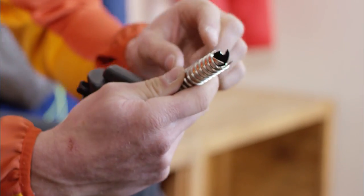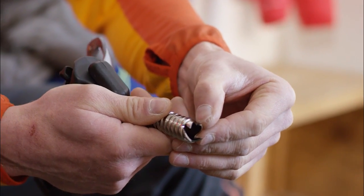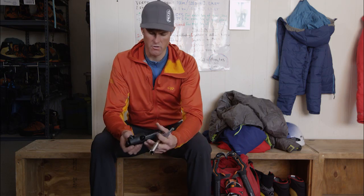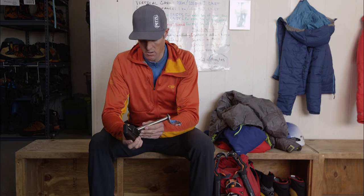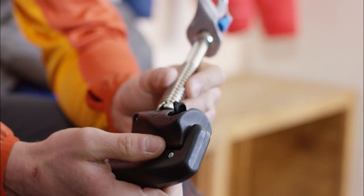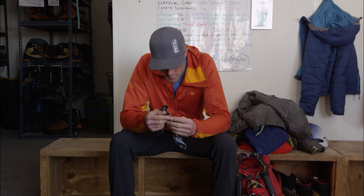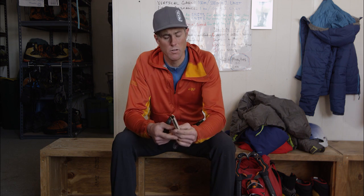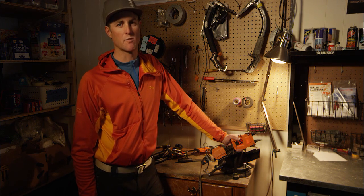When I sharpen the screws, I'm looking to sharpen both the leading edge and the cutting edge — the more vertical one. There are two guides on this. I'll start with the leading edge, then do the cutting edge. Looks good — good as new. Remember, keeping your ice screws sharp is really crucial when you're leading. That's how we sharpen the tools and crampons. If you keep up on it and touch them up before you head out, that's going to help keep you climbing well.